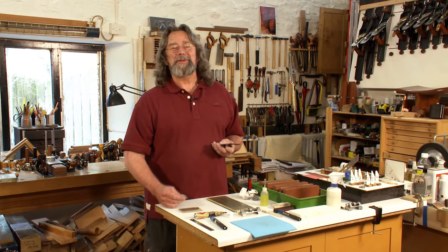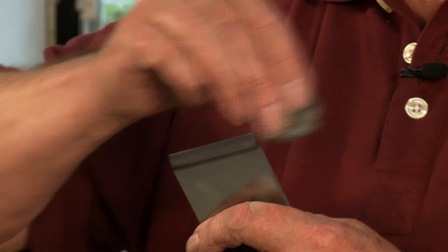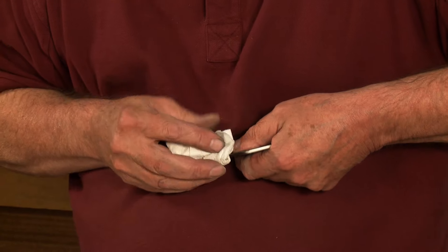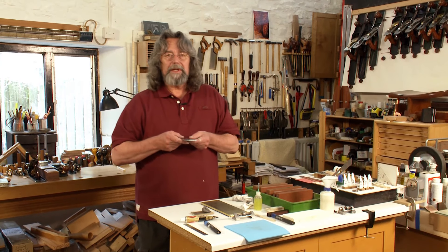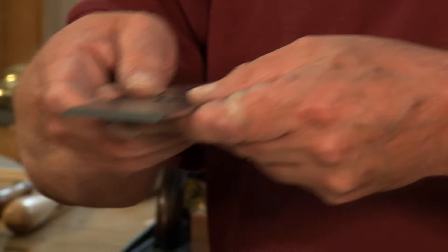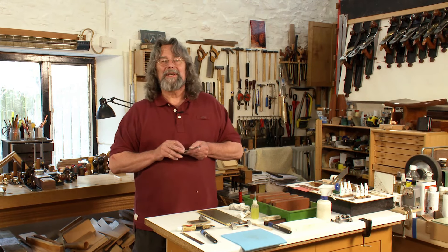Final steps. This may be extremely sharp, so I'm going to allow myself one little rub in each direction just to remove the extreme sharpness, and then I'm going to polish with paper. Do be careful not to cut yourself — this thing is sharp now. This is why you always see craftsmen being so careful when they remove a chip breaker: they pull it back from the edge and slide it across. It's partly to avoid damaging the edge, but also to avoid damaging this precious edge on our chip breaker.